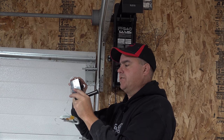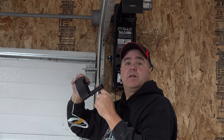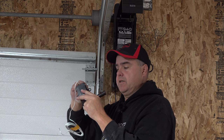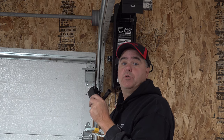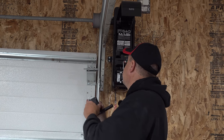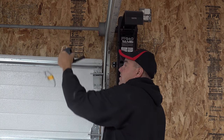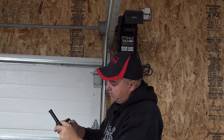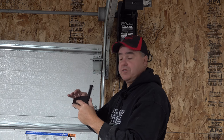This is an interesting piece — they're calling it the cable tension monitor. It's going to rub against that cable, and if the cable gets any slack in it, it will allow this thing to collapse. When it collapses, the door opener won't work. So the door opener can only work when this cable is tight. It's really quite simple inside — just a little contact switch. As long as it's open it'll allow operation; if it ever closes, it won't.